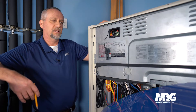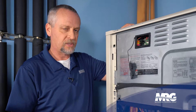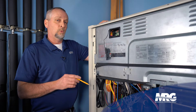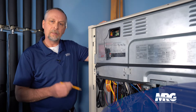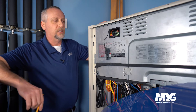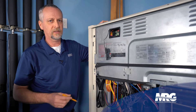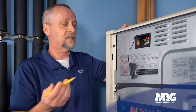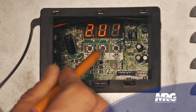Now we have to press the set button a certain number of times to select the emergency operation for locking out compressors. I have two compressors in this condenser — a primary (lead) compressor and a sub compressor. During troubleshooting we would have determined which compressor failed, so we know which one to lock out. To lock out the primary compressor, I need to press the set button 38 times. One of the cool things on VRV4 is you can hold the set button down and it'll count up automatically.